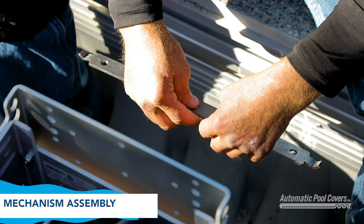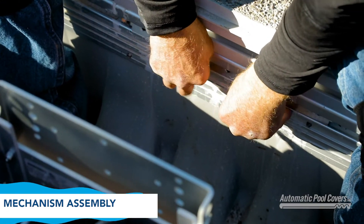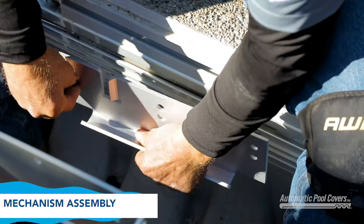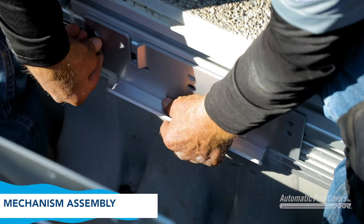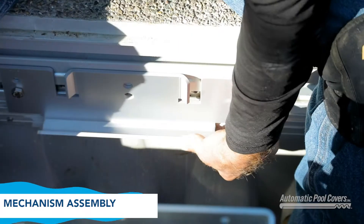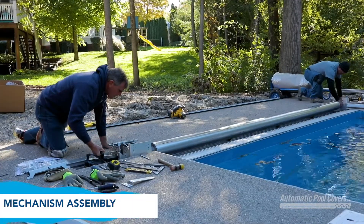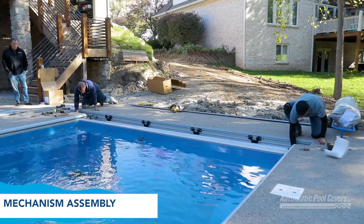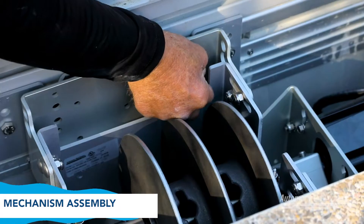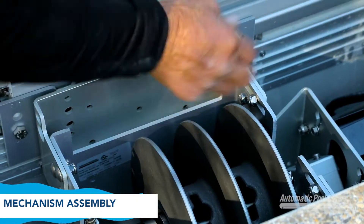Tilt the channel plate back and insert into the bracket. Then slide the bracket up to the top of the channel and let the channel plate rest in place. Install the bolts into the UT (under track) holes of the bracket. Leave the bolts loose to allow for adjustment after the next step. Lower the assembled mechanism onto the hanger brackets. Ensure that each mounting bracket is straddling the proper hanger bracket and loosely fasten the mounting bracket to the channel plate through the hanger bracket with bolts.